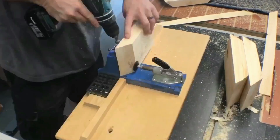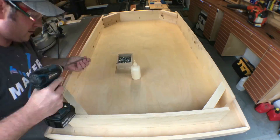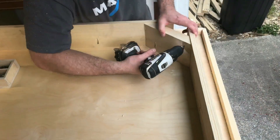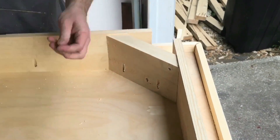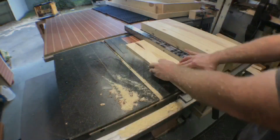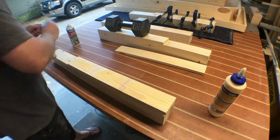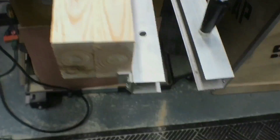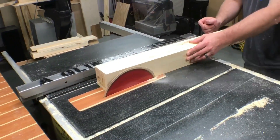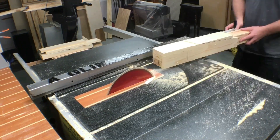I was lucky to get a few pieces of 2x6s with this, because I'm going to use these as the corner brackets that the legs are going to be lag-bolted into later on — these pieces will be plenty strong to hold the legs in place. They go in with little pocket holes and a little glue, then I pre-drill two holes and put in some inch-and-a-quarter screws on each side to hold it in place. To make the legs appear a little bit thicker, I'm going to take these 1x3s and glue them on two 90-degree sides of the legs. Then I take them to the table saw on this tapering jig, which takes a wedge out from top to bottom on two different sides 90 degrees from each other, giving that nice tapered look you commonly see on a lot of tables these days.